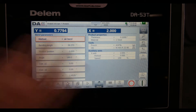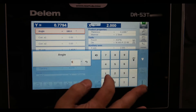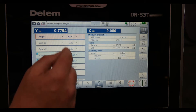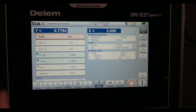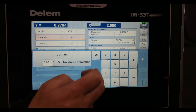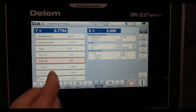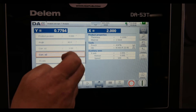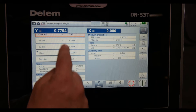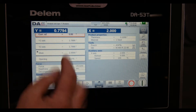Product position is in your Z direction across the machine. For bend angle, I've got corrections — I just changed my springback. If I formed something and it's a quarter degree open, I would add minus 0.25, and I can add this to either Y1 or Y2 or globally to both sides. The material thickness I've got programmed determines where my ram is going to penetrate and the depth it's going to finish at.